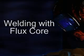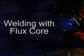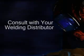In certain situations, such as welding outdoors, you may find that conditions prevent you from using an external shielding gas. When this occurs, it may be necessary to use the flux core arc welding process with self-shielding wires. There are two main types of flux core wire: wires that do not require external shielding gas, and wires that do require external shielding gas. Consult with your local welding distributor to determine what type of flux core wire is best for your application.